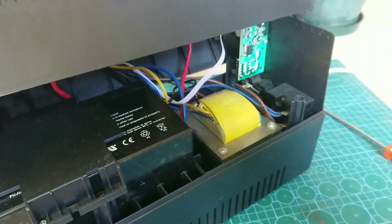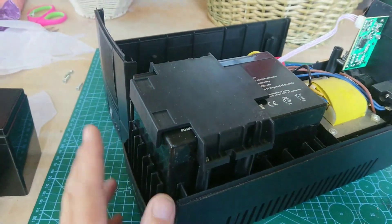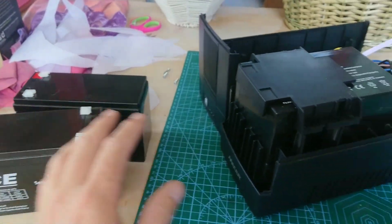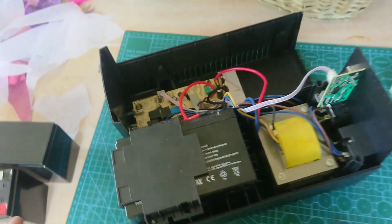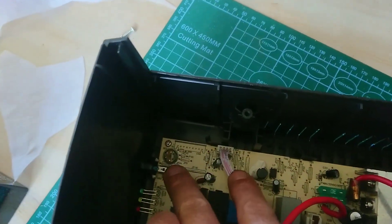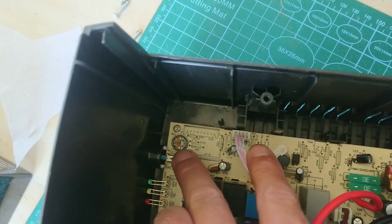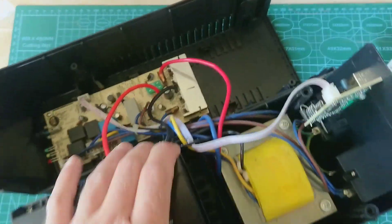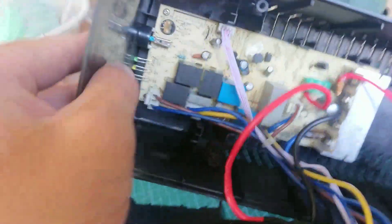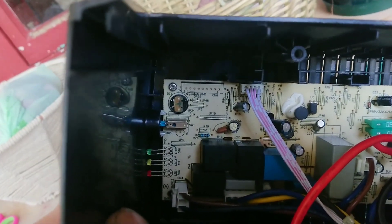So I just want to show how easy it is to stop that. You basically open up the unit — all of these units are more or less the same. This is the 24-volt one, so there are two batteries which I'm replacing because these are buggered. But on all of these circuit boards you get a buzzer — right there, that's the beeper. On the 12-volt ones you'll find it on the circuit board in exactly the same place, next to the on and off buttons on the inside.